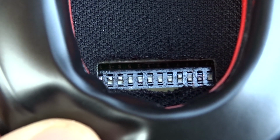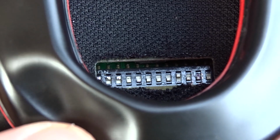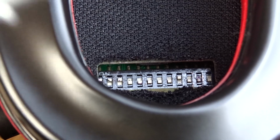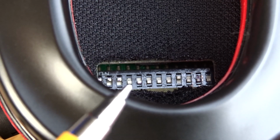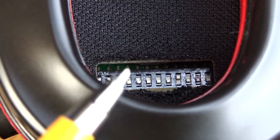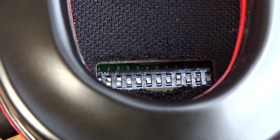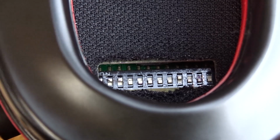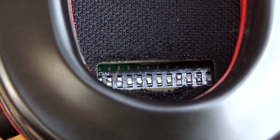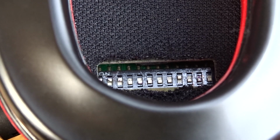So this is actually a configuration I've got. For the audio going out from the GoPro lead, you need dip switch 3. Sorry, correction, that is dip switch 3 there. That's the side tone. That's what allows the intercom to work. And everything that's up is on, and everything that's down is off.